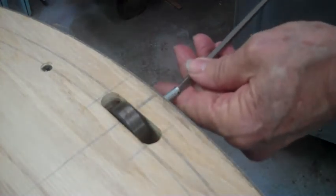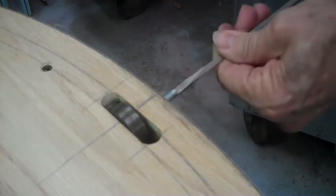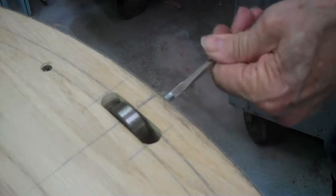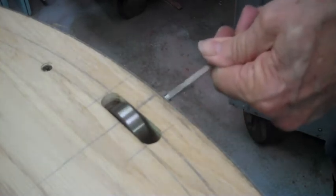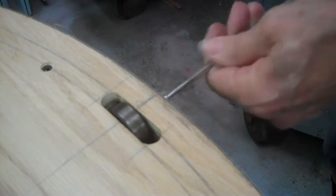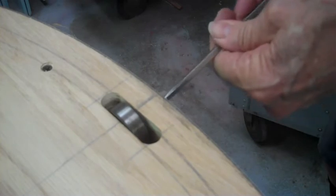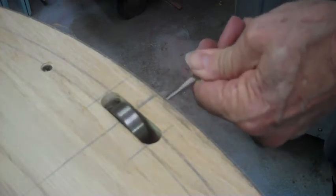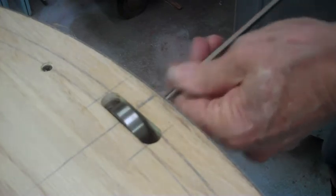And simply going to thread the stud in. And I think I mentioned before, I didn't really have a tap that was long enough to get up in there that far. So I just used a quarter 20 bolt, a long one, with the impact wrench, and kind of pre-threaded it.